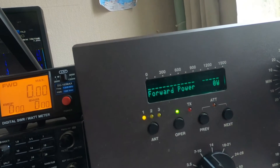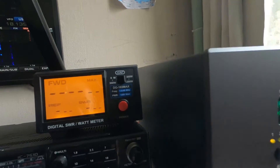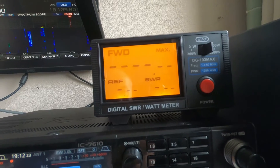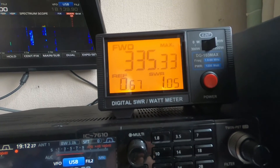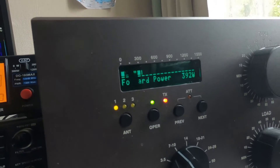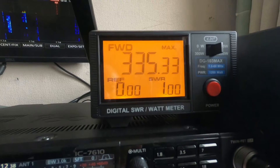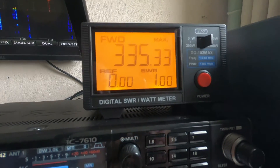Changing the display to output forward power. Test test test - it takes a second or so to get itself sorted out. Hopefully in a moment it should start showing something. It's reading 335 on the SWR power meter, and on the amplifier we're getting about 370 to 385 watts, so they don't really match up very well.